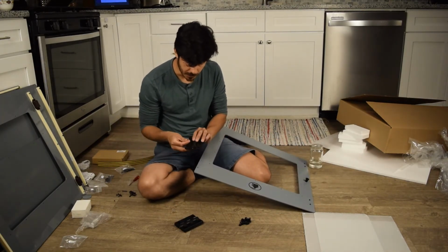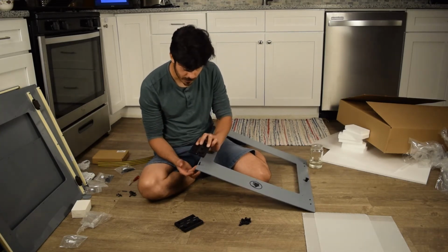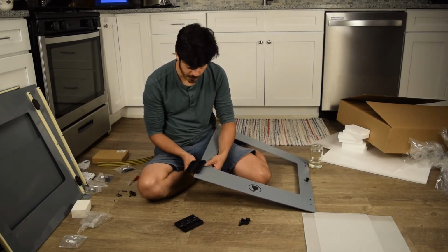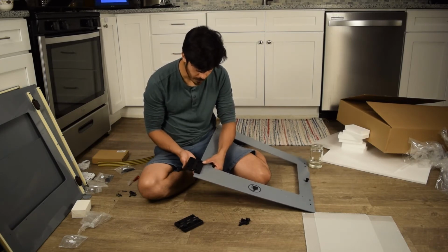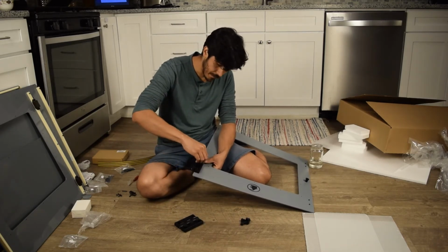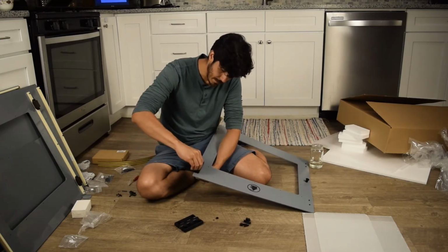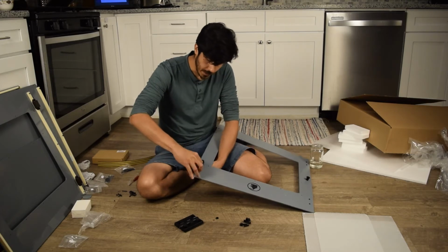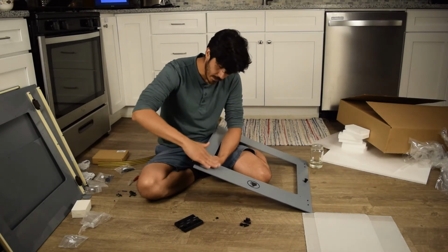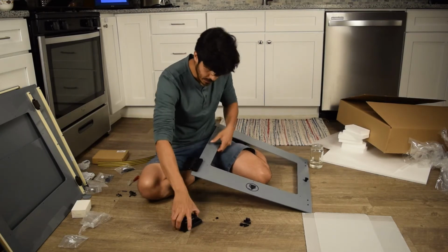Okay, when it comes to the door, for this side, you go inside, out. Inside, out. Okay, so for the front of the door, start on the inside and come out. Put the nuts on. Don't tighten the nuts. The reason is you want to get this thing squared off before you tighten it. It should square pretty easily. Shouldn't be really much work, but I like to keep the nuts somewhat loose.